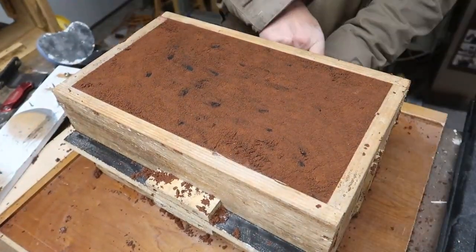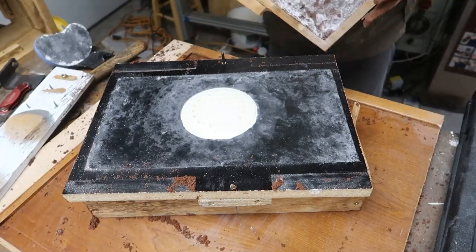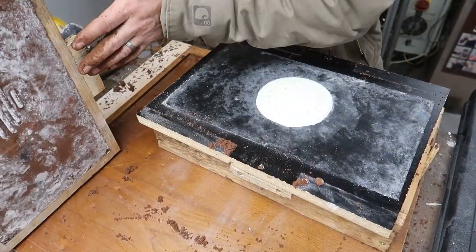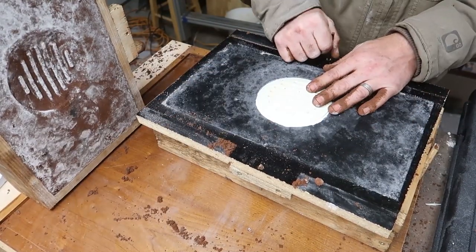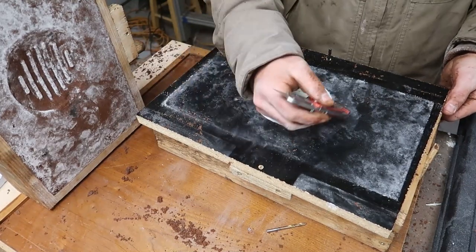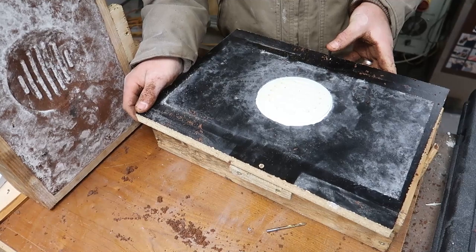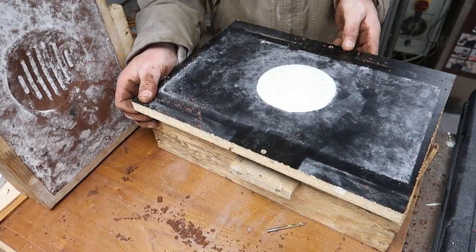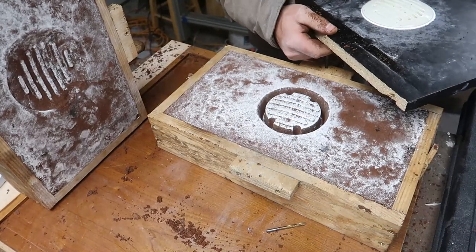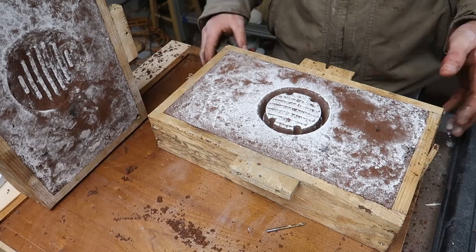And so at this point, this is pretty worrisome. This is kind of where you separate the mold. And I wasn't too worried about that very short one, so I kind of just grabbed and yanked on it. You see, it came right off. Absolutely beautiful. Pretty stoked on that. But this part, this was the 3-degree draft, deep draw. Give a little tap, maybe shake it loose, and feels like it's doing pretty good, but you never know until you actually get it off. And looks good to me.